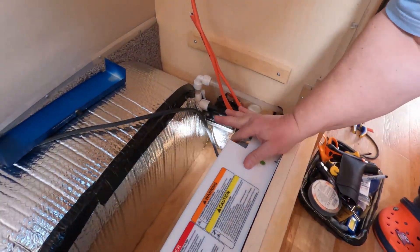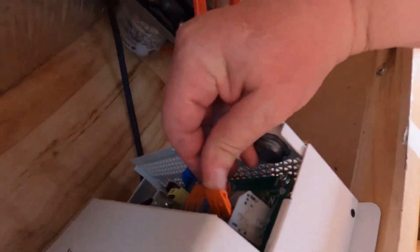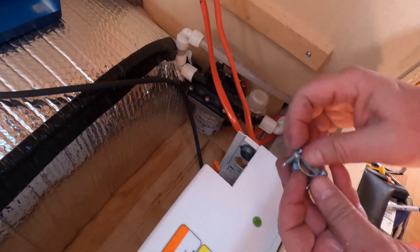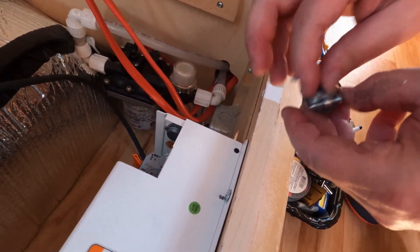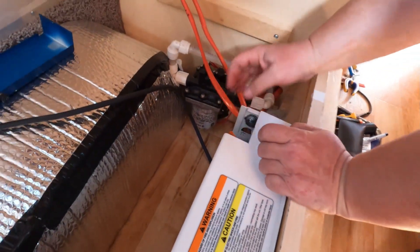The wires are going to go into these little lever connectors and then you just flip them closed — they're very strong. This pinches down on the wire; you just want to snug it. You're not trying to really compress it or anything, but it keeps the wires in place from sliding in and out or moving around.